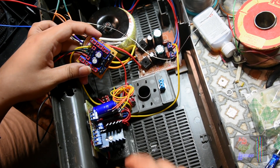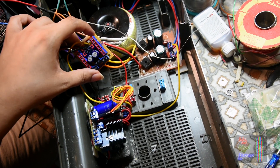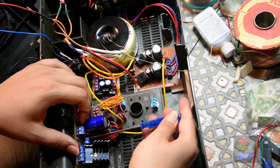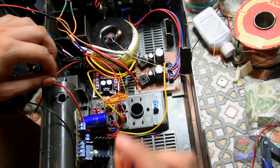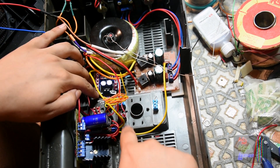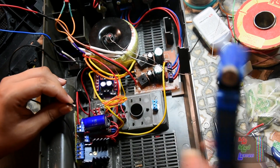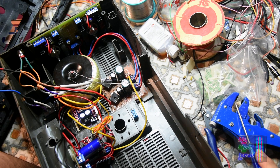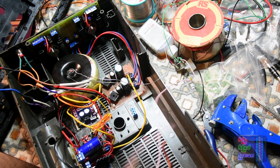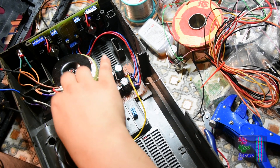This is the voltage multiplier — you put one 12V and one 15V in and it gives you lots of outputs. I'm not going to stick that down just yet; I'd rather connect everything to it first, then fix it down in the end. So that's the 15V output going into the 15V section of this, and the 12V goes into the 12V section. The ground needs to go into the ground, which is here. Let's connect the grounds from the regulator first. I hope this doesn't get too wiry and messy — probably will, but we'll try to keep it as tidy as possible.